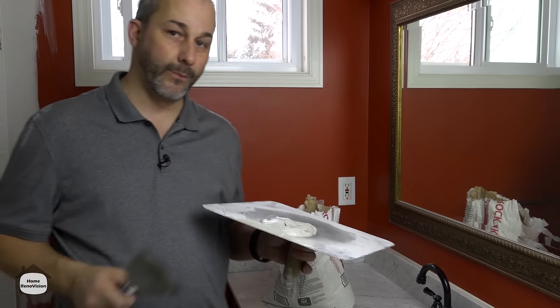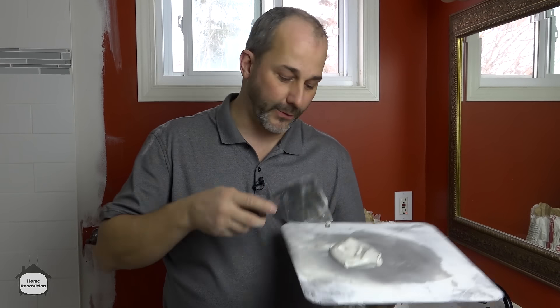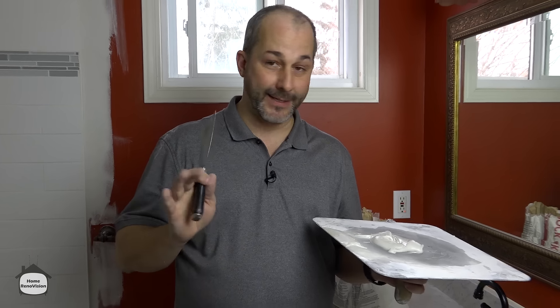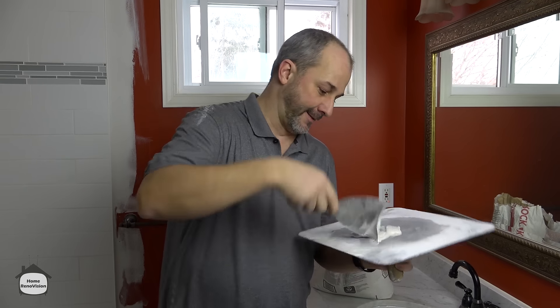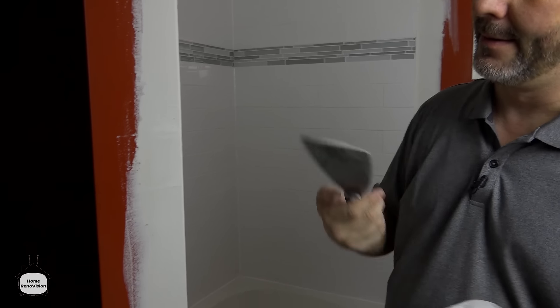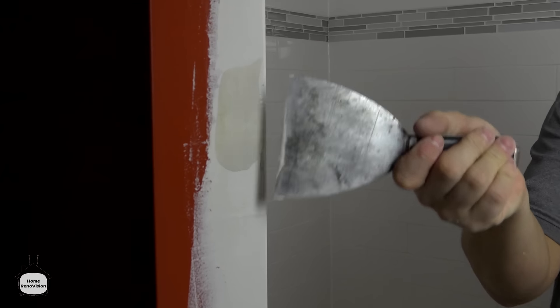Generally, 45-minute mud with regular cold water takes 45 minutes to an hour to set up, but if you add hot water you can be sanding this in 20 minutes. If you add really hot water, or if you live in the country and you've got lots of minerals, be careful — this can set up in 5 to 10 minutes. So we'll apply some of this mud here. This is my finish coat, nice and tight. I'm really pressing this on, and the goal is to fill every little scratch, every bump, so that this wall is nice and smooth.